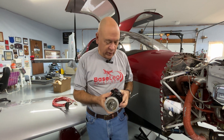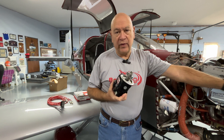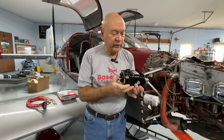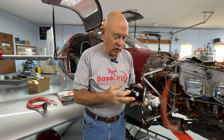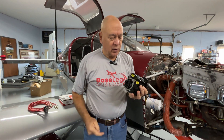We'll show you that all wired up. You install this magneto just like any other — bring the engine to 25 degrees before top dead center (six-cylinder Lycoming with stock pistons). Remove the number one plug, set it up for 25 degrees BTDC, pin the magneto to hold it in place, insert it into the slot on the engine, then use a buzz box to adjust for final timing. Then we'll wire up the Sure Start and attach it right here on the retard breaker terminal.